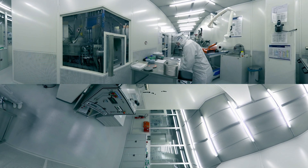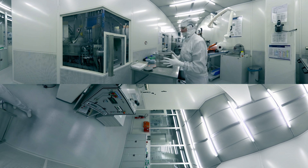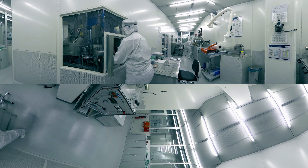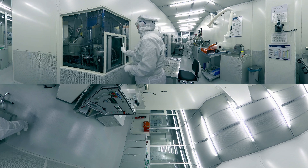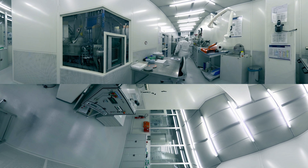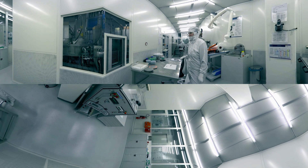The last step of the sensor fabrication is the deposition of the sensitive layer. An amorphous metallic layer is used, deposited by magnetron sputter deposition. Our sputter device has two built-in magnetic rings, which allows setting a magnetically preferred orientation already during sputtering. Single chips as well as wafers up to six inches can be sputtered.